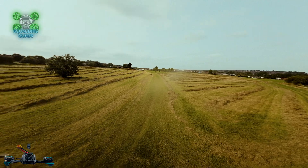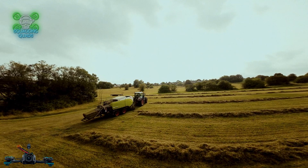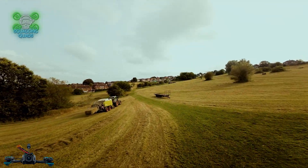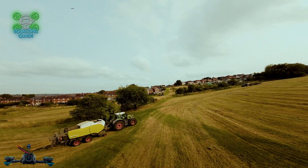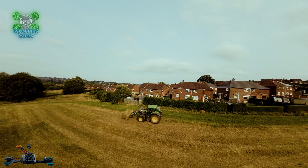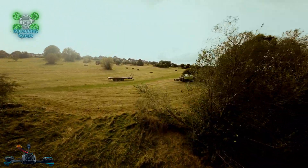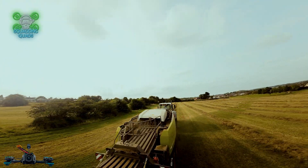The GPS can stay above the O3, by the way - I was getting between 12 and 18 satellites within 30 to 45 seconds directly above the O3, so it doesn't cause interference. The further away you get the GPS from the O3, the quicker it'll pick up satellites, but it isn't a problem. So it is going to be one that stays and you'll see a lot more of it on the channel. If you want to chill, freestyle, do medium range, and stay under 250 grams while subverting these absurd laws around FPV drones, I would absolutely 100% recommend the Oasis Fly 25 from Sub-250.